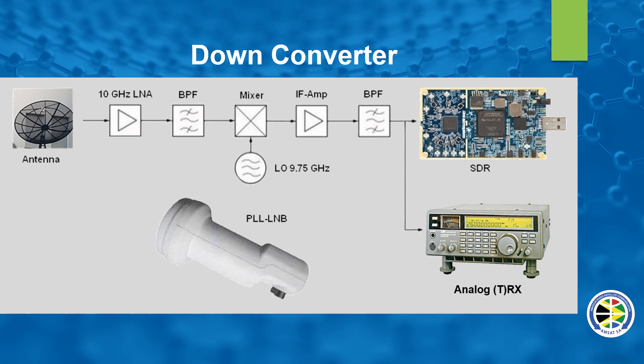We do sometimes throw out that little oscillator and put in our own — chuck out the 25 MHz crystal and put a Leo Bodnar GPS disciplined oscillator in. That makes it very stable because as temperature goes, these things drift. For TV it doesn't matter if it drifts a megahertz, but not when you're going to work SSB or FT8. So we prefer to add a GPS reference and keep things very, very stable.